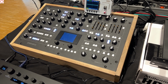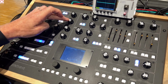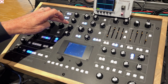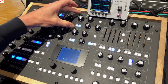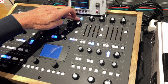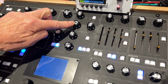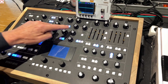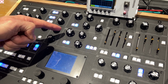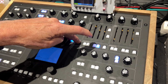Everything is classic. And now tell us something about the filters. These are 2 different ones. So you go in the mixer: VCO1, sub 1, with 4 wave shapes, VCO2 and noise. Then we have 2 filters, one with the SSI2040, only low pass, 12 or 24 dB, plus cutoff, resonance, envelope, which is not working today, and I'm working the envelope through another button, and another drive. The other filter is based on the AS3320, multi-mode, 12 or 24 dB, low pass, band pass, high pass, notch.